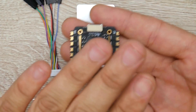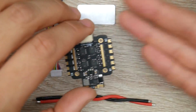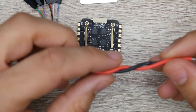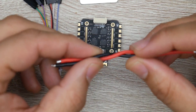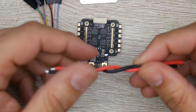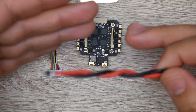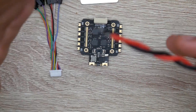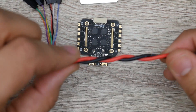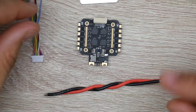It might run fine, but I don't think the overall longevity would be really great, especially if you take a look at some of the things they provide in the package, which is the power wires that will be connected to whether you're XT30 or XT60. These are 18-gauge — they're really small — and this is telling you that this should be installed on a micro quadcopter, not a 5-inch setup. Something under 4 inches would be great for this that's capable of running 6S. I don't recommend you set this up on a 5-inch quadcopter. This is really meant for a micro — you can tell by the stuff they're providing in the package.